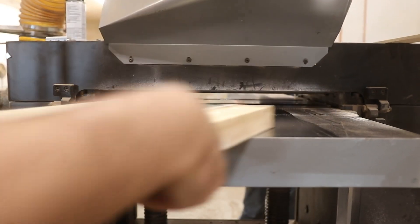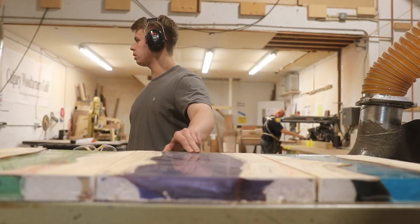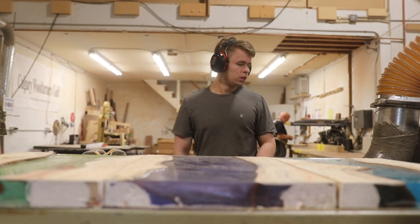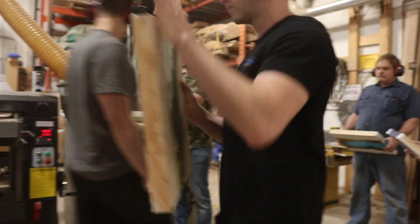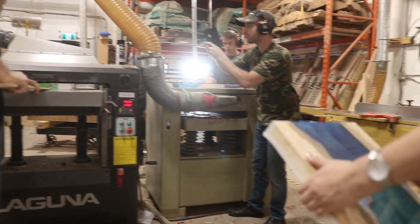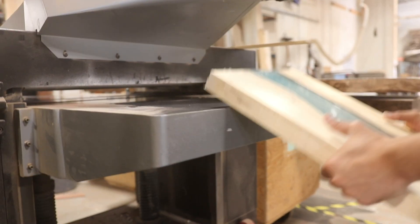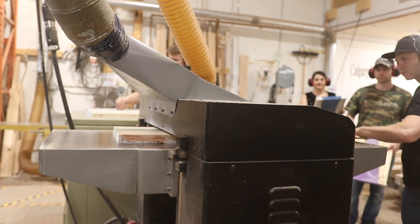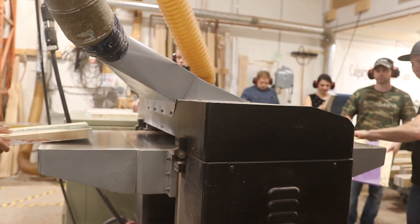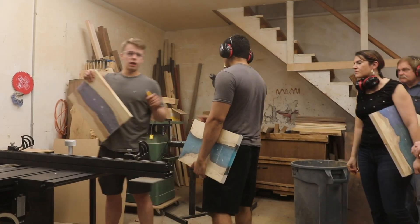We should clean this side up all the way and then flip. We'll do one or two more passes — however many it takes to get this side completely evened out — and then we'll flip them. I'm going to change this to 2 mils. One thing we've got to make sure when we go to make this cut: if you've got a little bit of a nub there, that'll throw off our angle when we go to cut. So if you do have anything like that, just use the knife and peel that off.